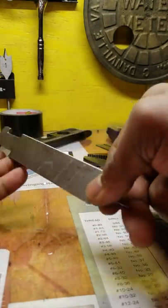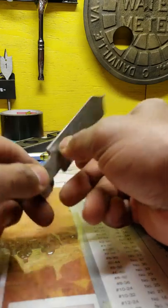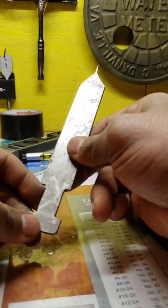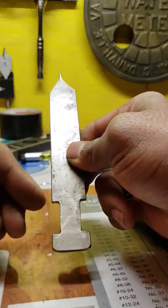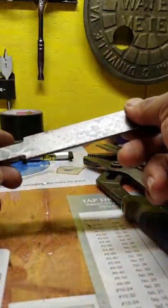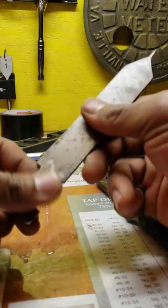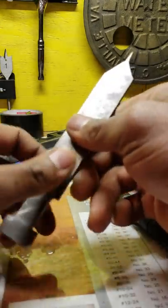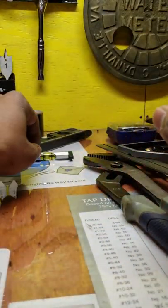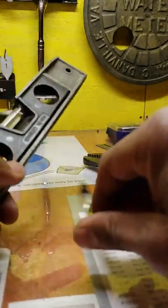This tool is used for cleaning out T-slots. I'm sure you can buy them online, but this is one we made in the shop — we made a batch and gave them out to the guys. Take it to the bandsaw, get a piece of metal, cut it out. Use it to clean the T-slots so when you're cutting on the mill, the coolant doesn't overflow onto the floor. You can clean them while your part is running and keep things moving. Time is money.